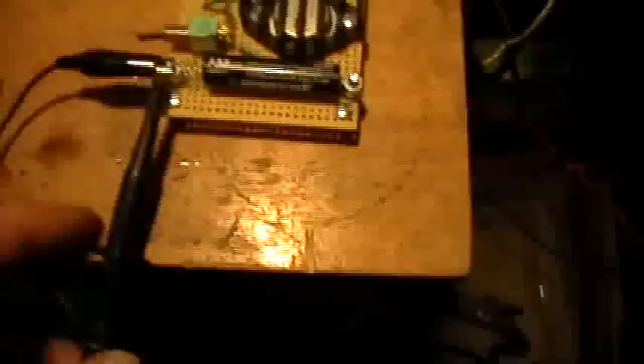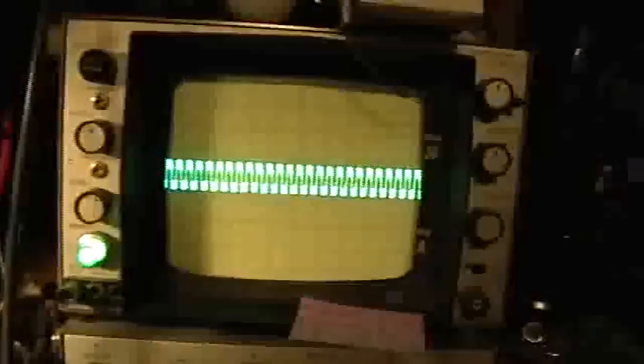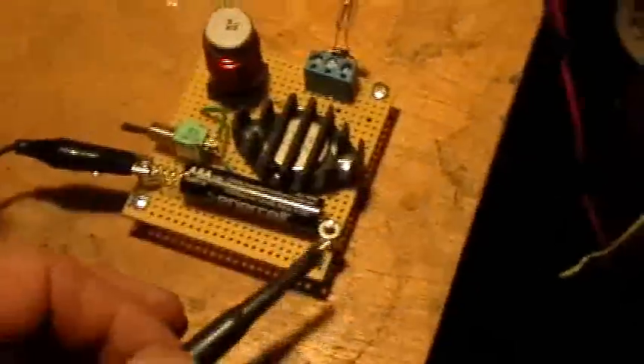So there's where the baseline is. What I'm going to do is measure the battery voltage by moving the probe tip to the other side of the battery. You can see that there - that's disconnected - and what you're seeing there is just some RF pickup from this other assembly I've got running right now. But when I hook it up to the battery, that goes away.